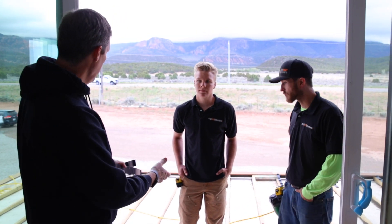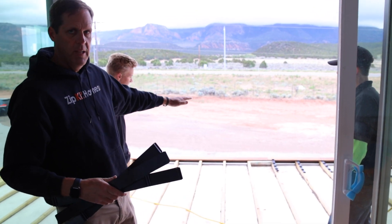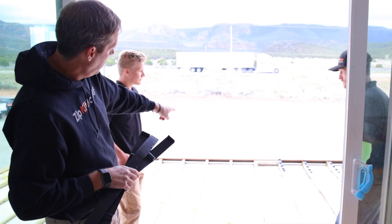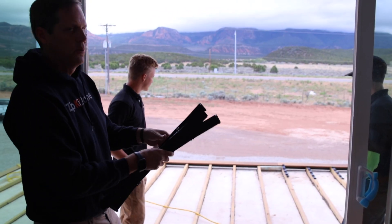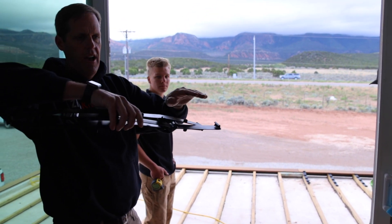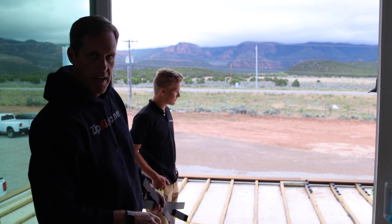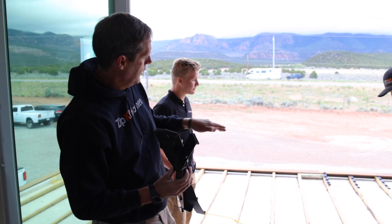Another thing I want to show you is what we have out here. We want the deck to be exactly flat. What we've done is the framing actually slopes so that all the water will run out. On that face piece you can see there's about an inch gap so water can run out, and then the deck goes on top. We put the decking on top so it's exactly flat, the water drains down, hits the slope, and runs out. That's what these pressure treated stringers are for — to flatten out the deck because the framing slopes.